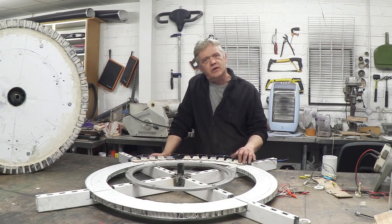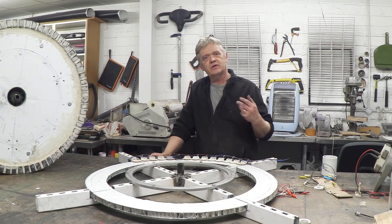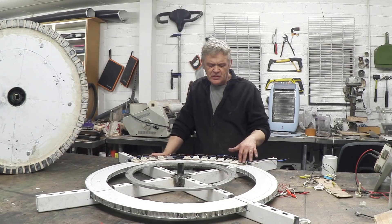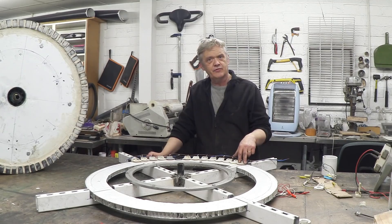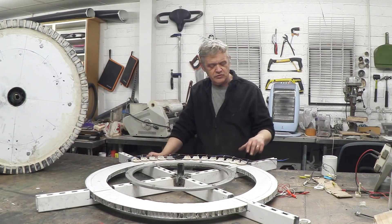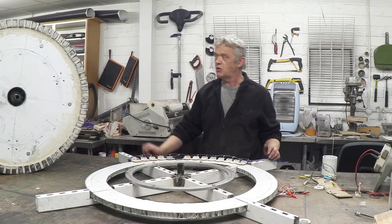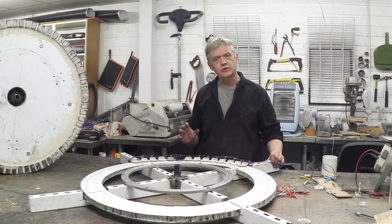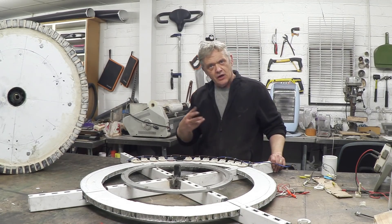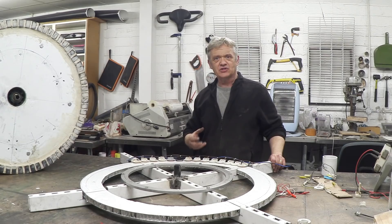These coils are a very fine wire, so even with the lightest pass they'll generate a huge voltage. At something like 10 rpm of that outer circle, this will generate about 15 volts — it generates milliamps, but it generates around about 15 volts. What I've got here on each coil is a rectifier. That's what I've done to change the design of the base, but not the design of the rotor. The driving idea of the base has not changed.